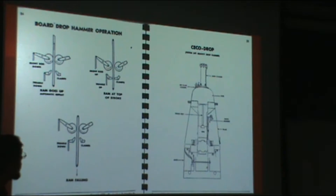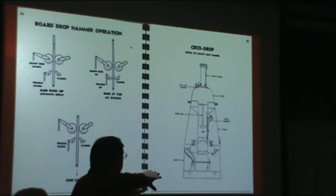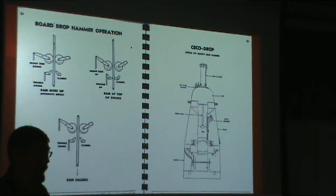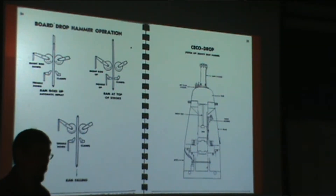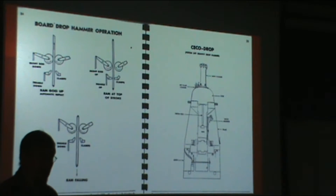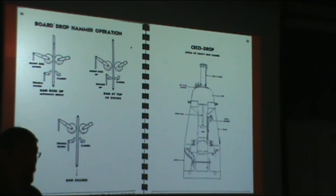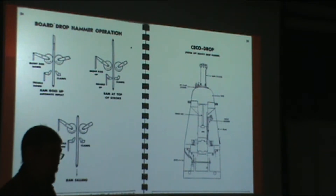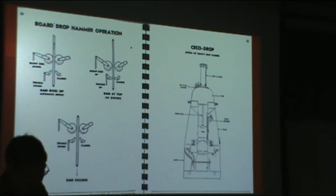There's an illustration of the lifting mechanism for a board drop hammer. This on the right is a steam cylinder. In a lot of shops today they've transitioned away from compressed steam and use compressed air — that's what was done at our Scott Forge facility a few years ago. The advantages largely have to do with safety: if you have a boiler generating compressed steam, you have to maintain and inspect it, usually with annual state inspections, because if it fails the boiler can explode. You can have an industrial air compressor without those safety issues. The only real difference is that seals inside the cylinders have to be changed for compressed air rather than compressed steam.